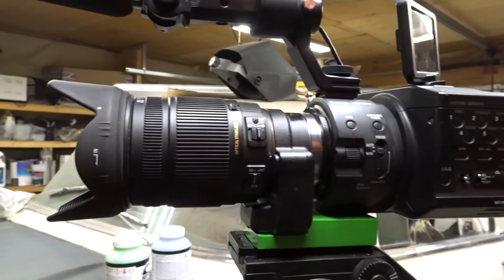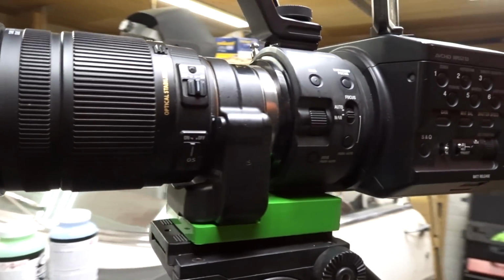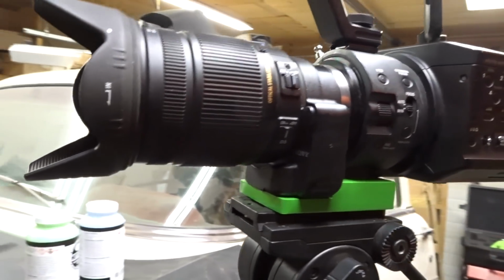And there's the finished product right there on my camera. Powder coating the mount turned out to be pretty good. I'm gonna end the video here of the Eastwood powder coating gun. First time use, definitely use a mask like I did. Make sure it's in a ventilated place. When you are baking it, I had the door open and then I went inside and then let it air out and come back.